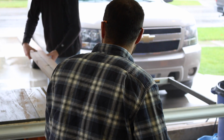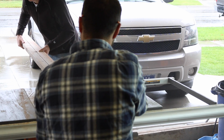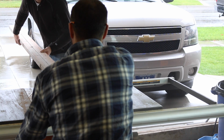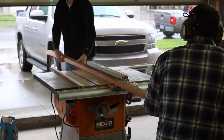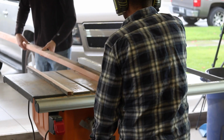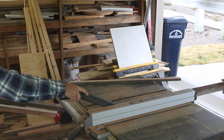We cut the 2x6 boards down to 3 inches wide using a table saw. Since 2x6 boards actually measure 1.5 inches, the thickness was already the same depth as the 1.5 inch thick canvas. We then ripped the remaining part of each 2x6 board down to 1 7/8 inches for the outside portion of the frame's depth. This extra 3/8 of an inch gives the frame some added dimension.